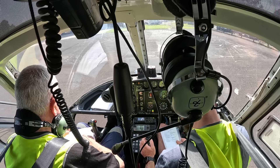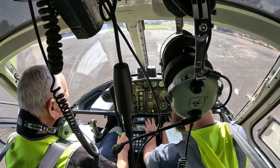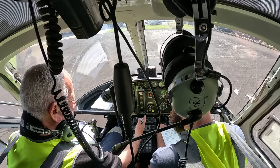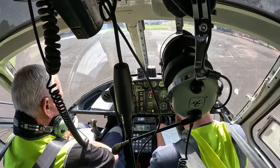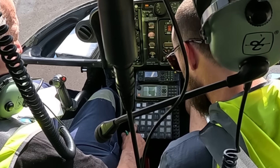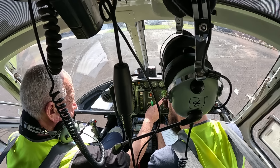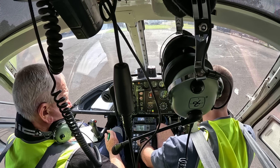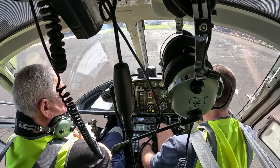Lighting circuits one and two test — that's those. One will give you those, the second is a standby one for night flying. Warning light test — check all working. Look up at your panel. You've got one in the corner here — it's a spare. The fire one takes a second. It should come on after the other one. There it goes. Have a look at what you've got: hydraulic, generator, gearbox — take your finger off — and engine, engine pressure.